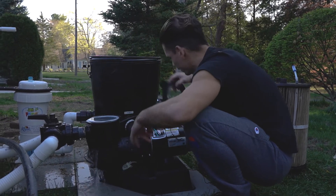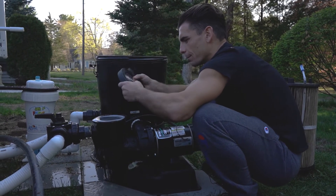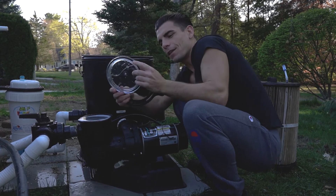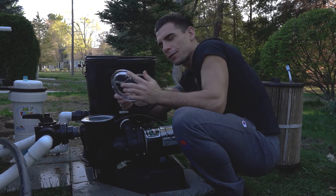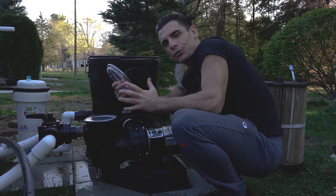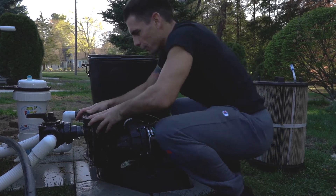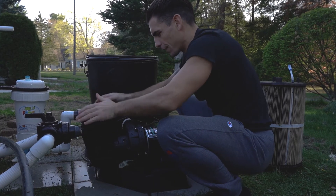Make sure the whole thing is clean and rinsed off. It's very, very important that when you put this basket back in, the hole here is lined up exactly with the hole where the water comes in. There's a little groove with a plastic spike where the basket is going to fit right into place. Then take the skimmer basket lid and put it back on. Keep in mind this lid is comprised of three parts: a plastic part, an outside part, an inside part, and the most important — the O-ring. If you ever take O-rings out of any part of this filter system, make sure you put them back on. Push the lid down, find where it grabs, and lock it in place.